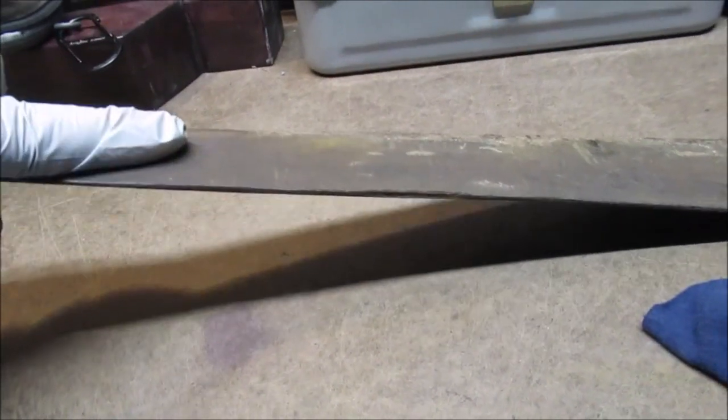Here's a quick shot - I took this to the angle on my vise and hammered that down. See how much metal is there? We can file away and put it back. Remember, it's only a machete. We're just going to hammer that down too. We're trying to put the metal back without heating it - this is soft metal, it's flexible. It's a machete - it'll work.